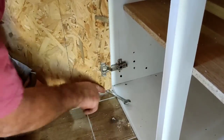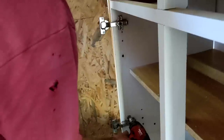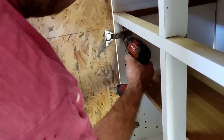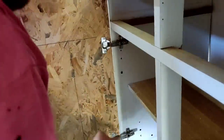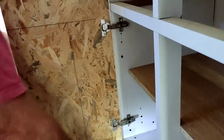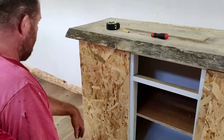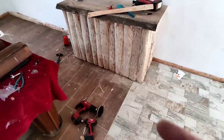35mm — make sure you're on that line and you've got your spacer underneath. Drill your pilot hole at 35mm centre. Same with the top one — make sure you're in the 35mm centre. With the adjustment you can move it up or down. There we go — one working door! In which I can then clad with whatever you like. That's a cocktail cabinet all clad. It does need a bit of a tidy up.